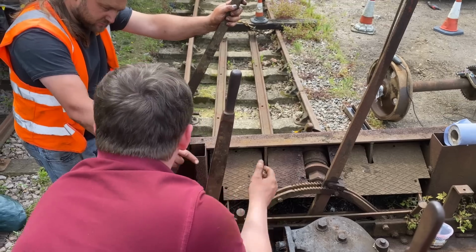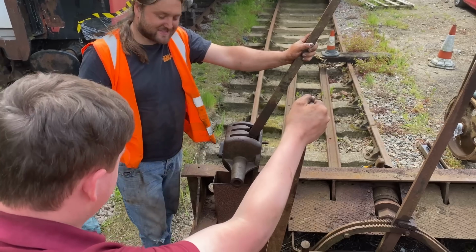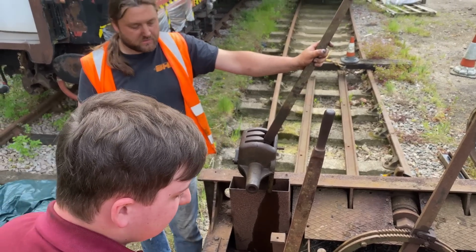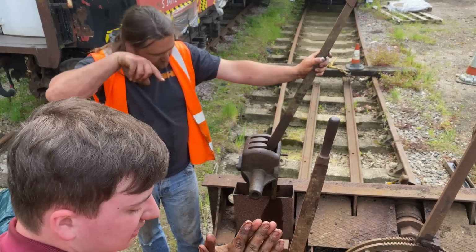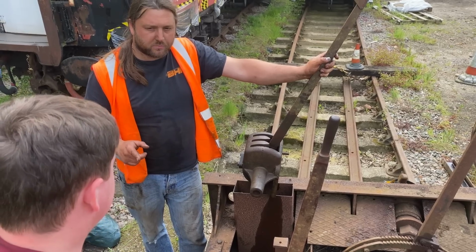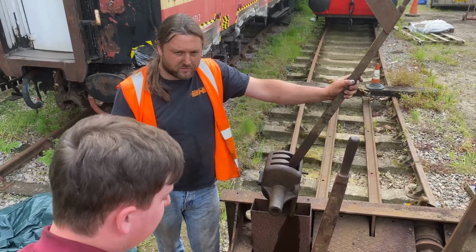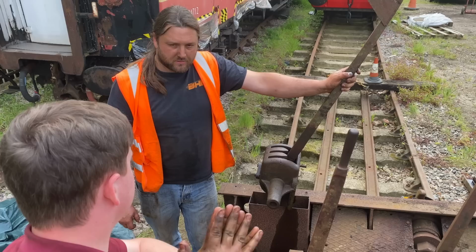But we're not in gear because when I turn that, we don't get the final drive. Yes, because we are in neutral. So we're in mid gear on that. So there's no final drive. So in theory, second gear clutch is bound or semi-bound. That will be locked up, which is why we can spin it, but the sprockets aren't turning. But that's also potentially a good thing, that if that is semi-engaged and it's turning, it means that inside the box it's turning. Yes, but it could also mean that the second clutch is stuck in position.